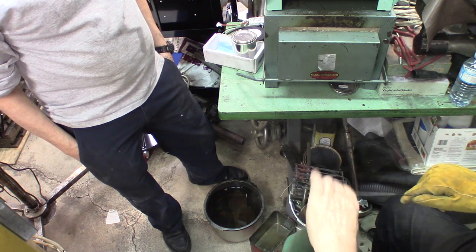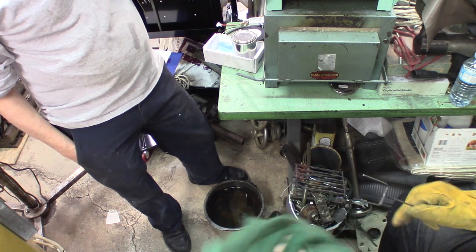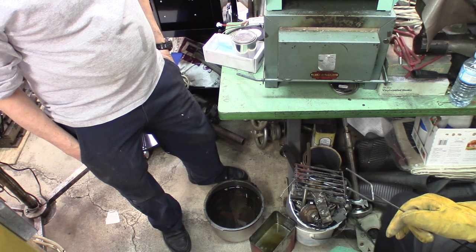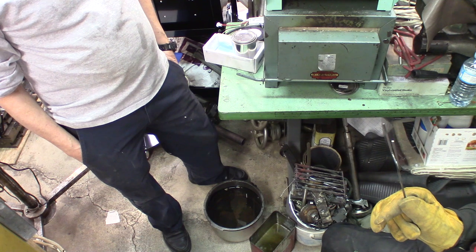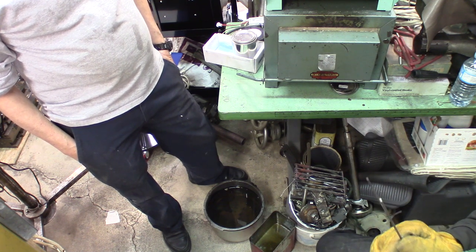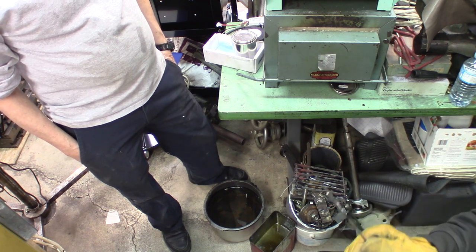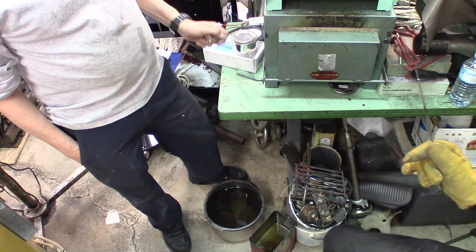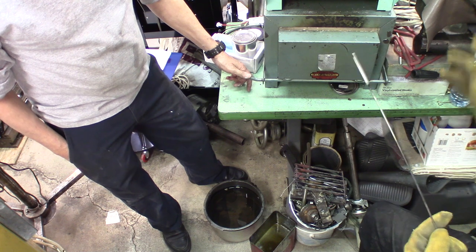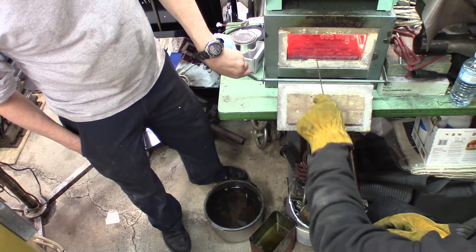Cleaning this up. Cleaning my utensils. The W1 in oil will get softer. A little bit softer. We'll see if we need to really heat treat it after, or just do a tempering of it. It'll be just sufficient like that to get supple enough so it doesn't break. Look, if we can get low 50s, we got something very nice, I think. What temperature in the oven? 1499. Okay, two more. In the water.